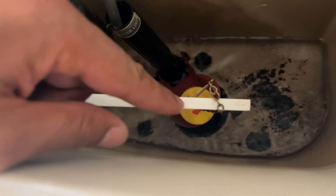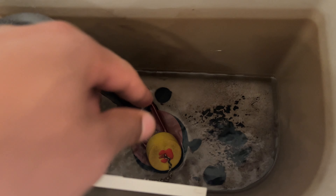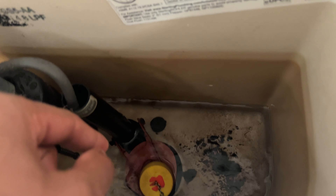In this situation, this cable right here — do you see this cable right here? This is the cable that connects this lever with the stopper. What I'm going to do — you can see right here it is tangled up, so I'm going to have to detangle it. And when I detangle it, the stopper sits right on top of the drain hole. And you can see that the toilet is filling up.